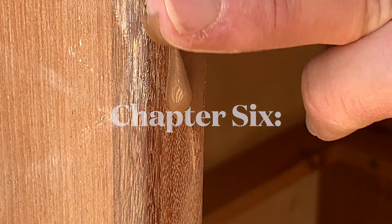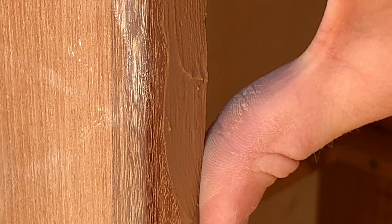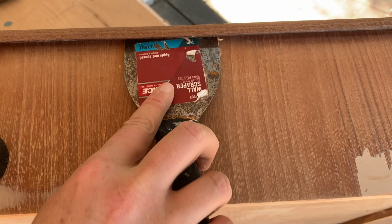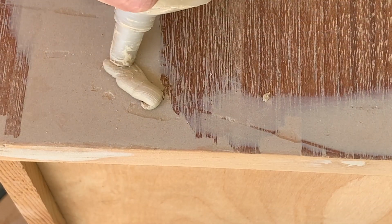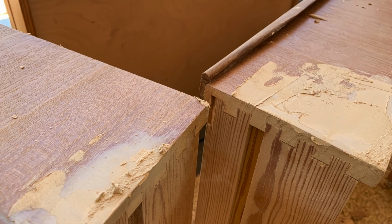After that, I noticed over on the body of the dresser, there was a thin gouge along that slender trim on one side. I got out some plastic wood in the darker color walnut and added a liberal amount over that. Still filling, I went back and using some more plastic wood, I filled that one damaged spot I had missed during the more frantic Bondo application, as well as over any of the little small imperfections in the original repairs. And then let those set up for a couple of hours.